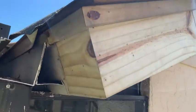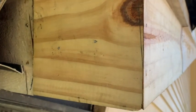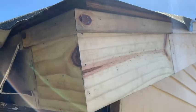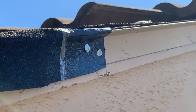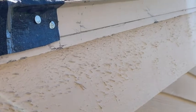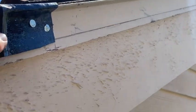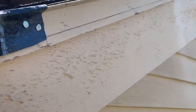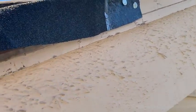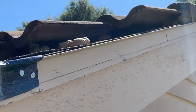There's the fascia board I replaced yesterday that was rotted. I cut a small piece right there and replaced it - cut it straight up and down because I couldn't get an angle. The drip edge is right up against the furring strip. We ordered some taller, longer drip edge - three inch versus two inch - so the drip edge will come out to the bottom of that furring strip and no water will get on the furring strip and be pulled back down onto the fascia board. That's where you get your rot.